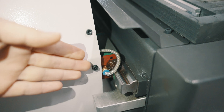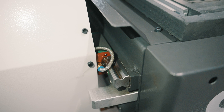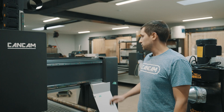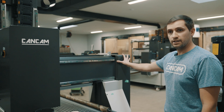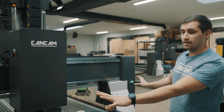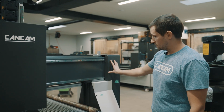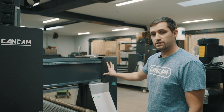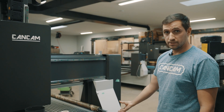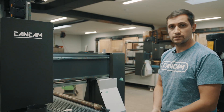As you can see with this linear guide right here, we have some grease coming out of the guide and we know that the grease is good for this location. Over here on the right side of the gantry is the farthest location from our oil pump, which is on the left side. This is going to be the location where the grease has the hardest time to get to. Check these when pumping the grease — if it reaches here and all the other locations, you're good.